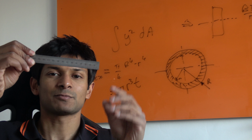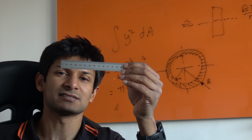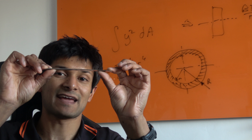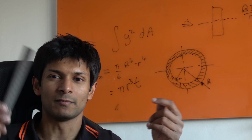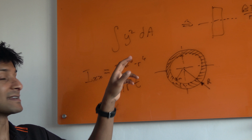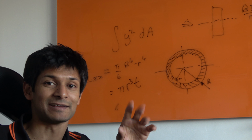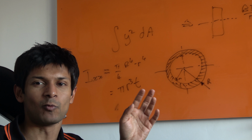And that's because the second moment of area in that direction, which typically as an engineer you would probably call the Y direction or the Z direction, is much more than the X direction. The actual coordinate system will vary, pick what you want. The formula for second moment of area is the integral of y squared dA. And I don't really want to make the maths all that heavy, so I won't.